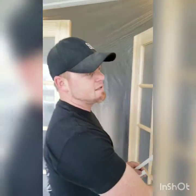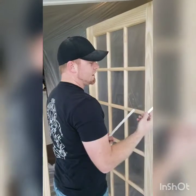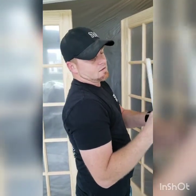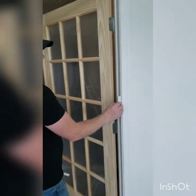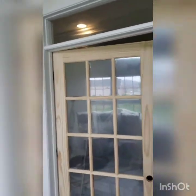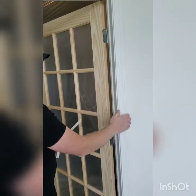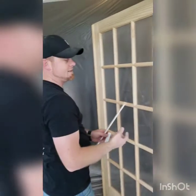We had some issues with the drywall not matching up here on the outside — this was a big opening. So what we ended up doing was Home Depot sells this really cool rectangular product that's just like a furring strip. We got those and it matched perfect. We installed those all the way around the edge of this interior to fur it out. Once we put the casing on, we floated the drywall mud out with 20-minute mud and then finished it with regular drywall mud on the last coat — just makes it easier to sand.